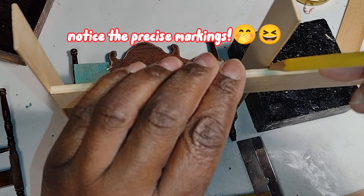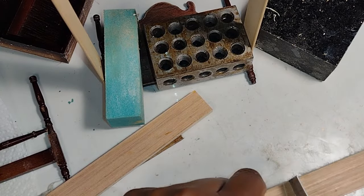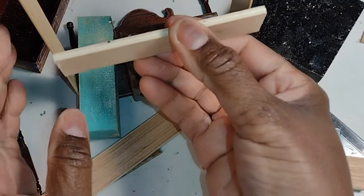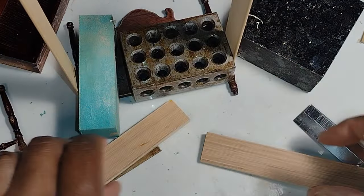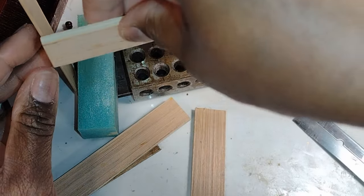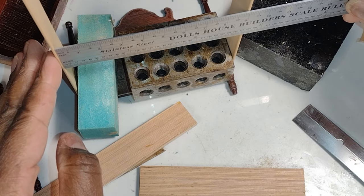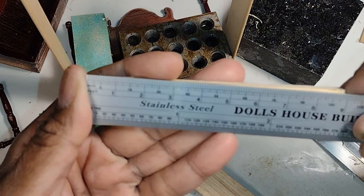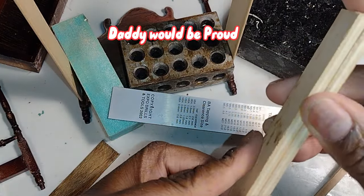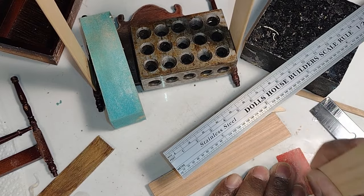It's a little bit different from the bed that I made where I upcycled the headboard. After I determined how wide the slats needed to be to fit in between my two side rails, I went on to cut two pieces. Generally I would cut three pieces for slats, but because these pieces were a little bit wider I just left it at two. When cutting slats to go between the side rails, you definitely want a tight snug fit, but not so tight that it causes the side rails to bow — just flush against the rails without creating any pressure. I was very pleased to realize that using the ruler is helping me get straighter cuts and neater, even pieces.